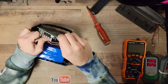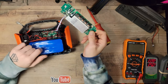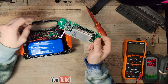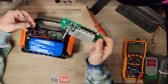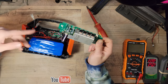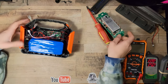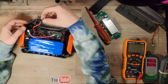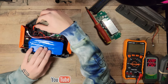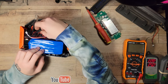I'm going to unplug the battery. The reason they had the battery going right to the inverter is because the inverter is what is going to be using the most current out of this whole box. So instead of using more wires, they use the ones that are already on the battery directly to the inverter to create the least resistance and a good current flow. All of the wires coming off of the battery carrying the pack level voltage are silicone wire, 200 degrees Celsius rated, which is good, along with all the balance lines.